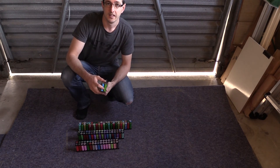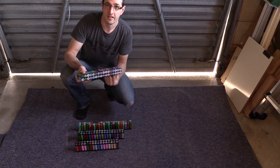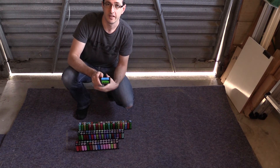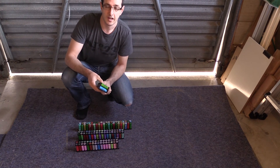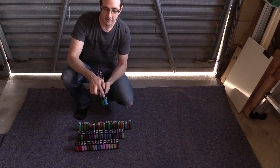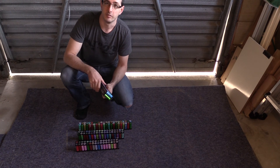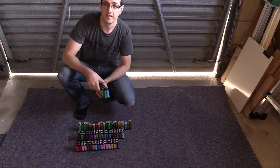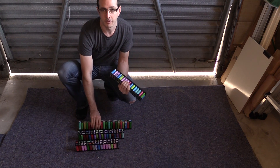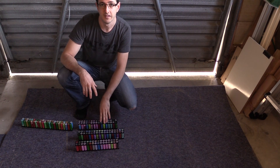The reason I've made the packs this width rather than bunching them up is mainly to make them easy to slide in and out, and so that if there's ever a problem with a cell it's not too difficult to pull apart and replace it. By keeping them slimmer I can achieve quite a few things, including only needing to solder up one middle bus bar cable, keeping it nice and simple. As I get more of the 2000mAh cells, I'll pull out the larger lower-capacity pack and replace it until I have all 15kWh worth of much better cells.